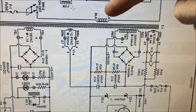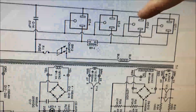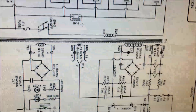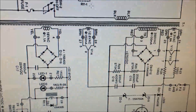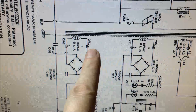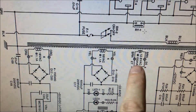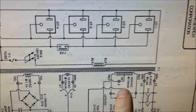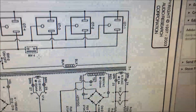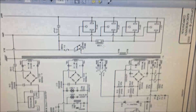If you'll notice up here, this is the input going to the power leads. There's a relay that controls the outlets I showed you earlier to switch other equipment. Then you get to T1 right here, which is the primary power transformer. If you come out the other side of T1, you'll notice there's two orange wires, two yellow wires, two brown wires, two red wires with a center tap — which is basically red with a yellow stripe — and two green wires. This is for the filament voltages, and this feeds other parts of the amplifier, but I'll show you what I'm chasing down right now.